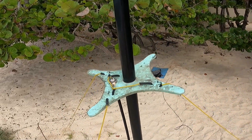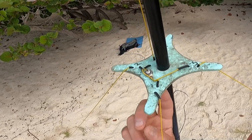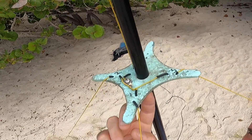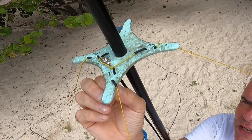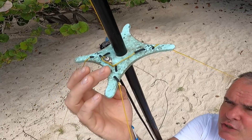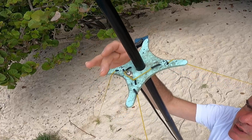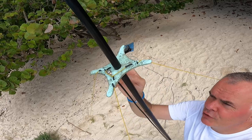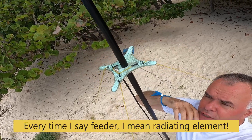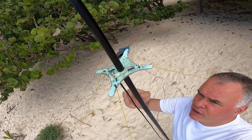They're just bits of wire, so it's not really much in your luggage. The key to this antenna is this piece up here. You can see these are the radials - I've looped them through this piece of chopping board and strengthened them with a piece of heat shrink wrapping, because there is a little bit of strain going on these, so I just wanted to remove any sharp edges. That's the same for all three radials. There are four legs on here, which basically gives you four winders: radial, radial, radial, and then feeder. When I'm dismantling it, I wind the radials on one at a time and then the feeder on last, and the feeder is the first thing to come off.